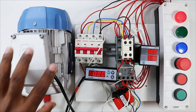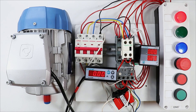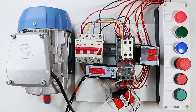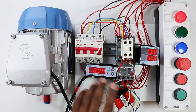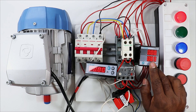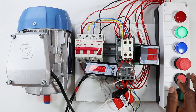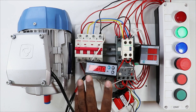Then it became zero because the current rating of this motor is very low — it is taking less than 1 ampere. Because of this, the ammeter is not able to show the current. The current range of this ammeter is above 2 amperes, meaning when above 2 amperes flows then only it will show. So at present, just understand how to connect this ammeter and how to program it. You can also see the hour meter here — it is showing 3.7, meaning my motor has run for 3 minutes. Now I turn off the motor. After turning off, you will see that the hour meter display is gone, but the display of my ammeter is still on.